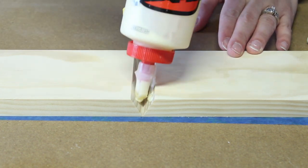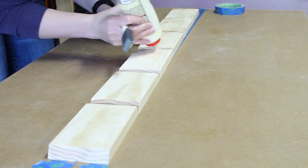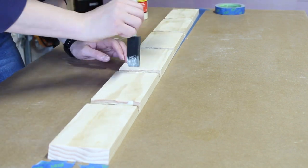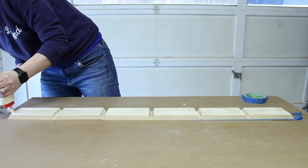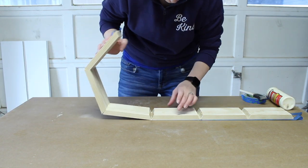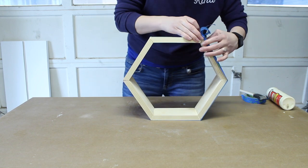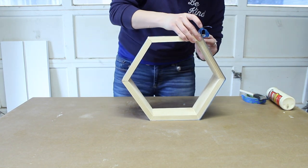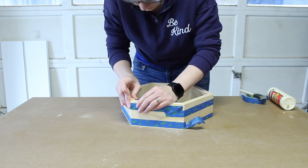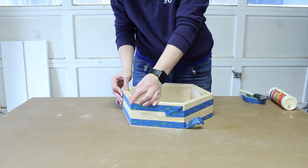I'm using some indoor wood glue on both sides of all my joints — applying a generous amount and then coming back to spread it out using a foam brush. Make sure you get good coverage through the entire surface of that joint, and do this in every groove and on the ends. Don't forget those ends because those will be glued together eventually too. Then I'm just going to pick up the ends of the tape and slowly start rotating my hexagon together, checking those joints to make sure the edges are aligned and bringing it up until my last two sides meet. Once they're nice and tight, I'll lay it down, secure the tails of the tape down to the board, and that will hold everything in place while the glue dries.